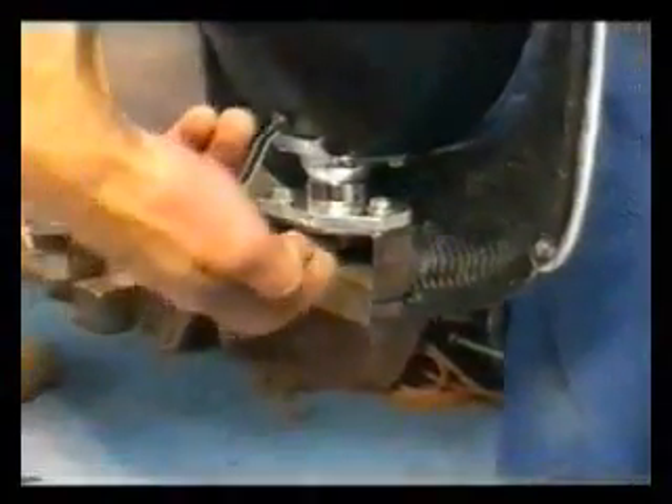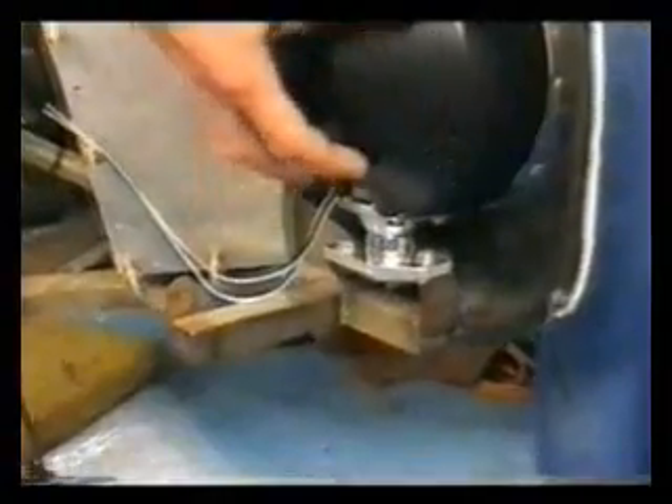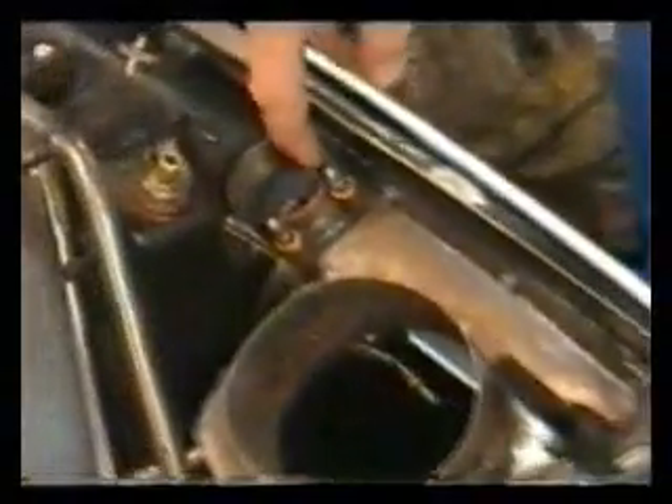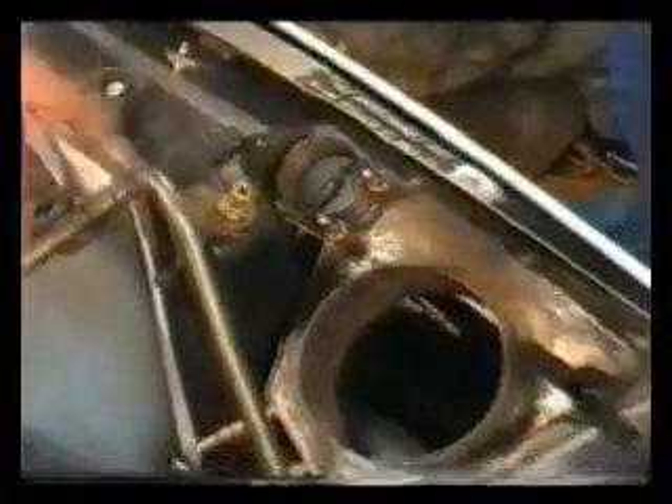The headlights are mounted as well. They're mounted on a basic spotlight unit on this plate. There's a big bolt underneath and a ball joint — this means I can set the angle of the headlight. And if I need to take it out, all I've got to do is undo the three bolts without actually altering the alignment. Up here that's one of the air outlets or ducts — the pipe can go anywhere in the car I want.